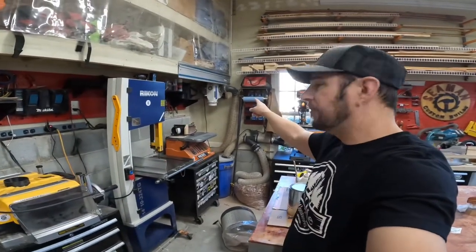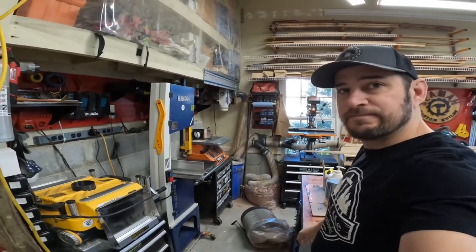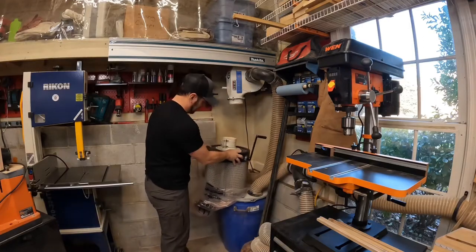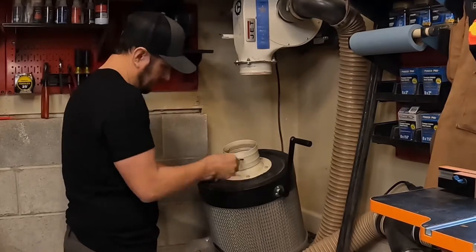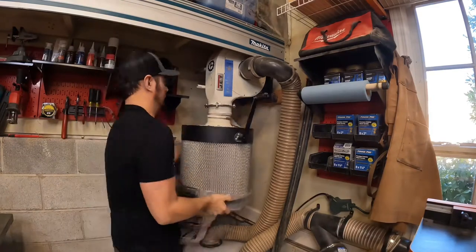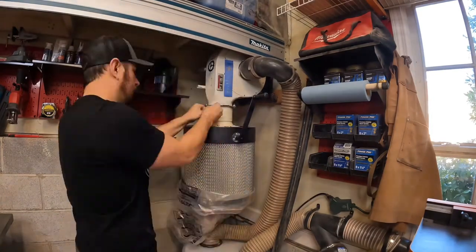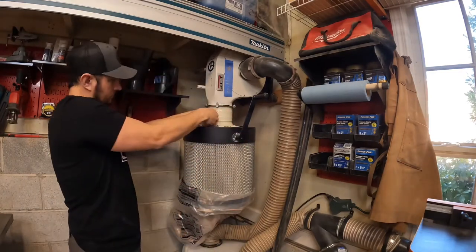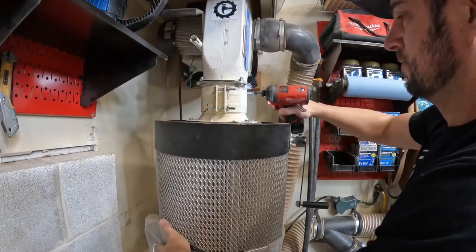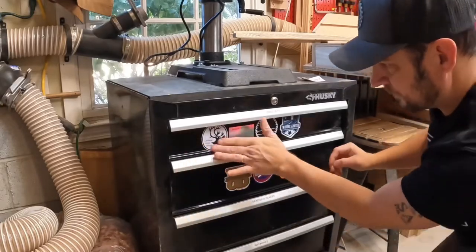The canister should be up on the dust collector, so I've got to get it reinstalled. This is not the first time it's happened — I thought I had it fixed better last time with the collar on good and tight, but apparently I was wrong. First step is to remove the collar. I use a strip of duct tape to hold it in place temporarily, which also helps seal that joint, then bolt the collar back on. Hopefully the ridges hold. I took the fix one step further this time and used some self-tapping metal screws — shouldn't go anywhere now.